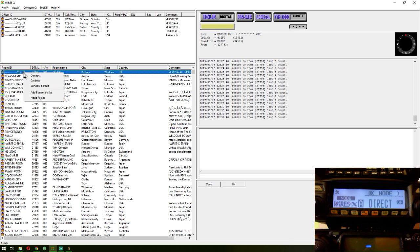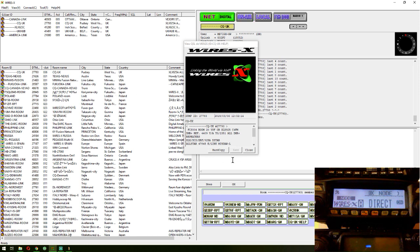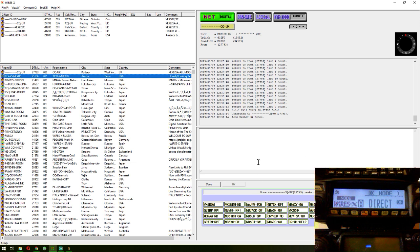So we'll go to CQ UK, which is the room I created in January 2017. And we're connected. As you can see, the radio is in direct mode, which means that there's no RF coming out of this radio even though it's attached to an antenna. Basically, putting it in WIRES-X mode cuts the RF to the antenna and just sends the signal via the programming cable - the SCU-20 or the SCU-19 if you're using an FT-2D - sending the signal straight to the computer and down the internet.